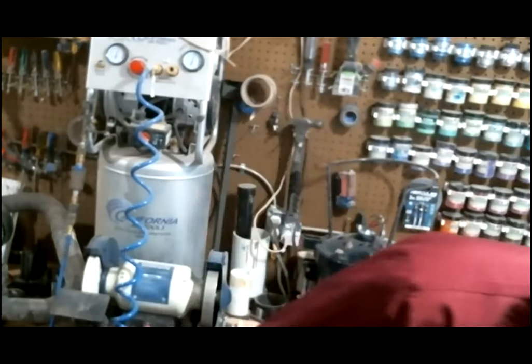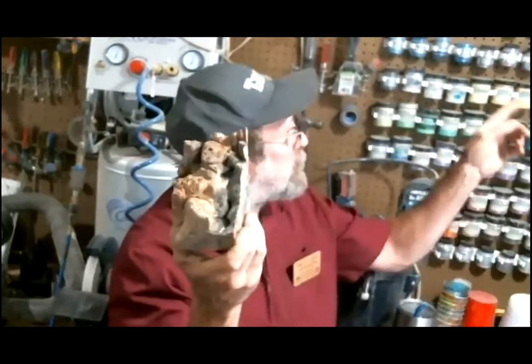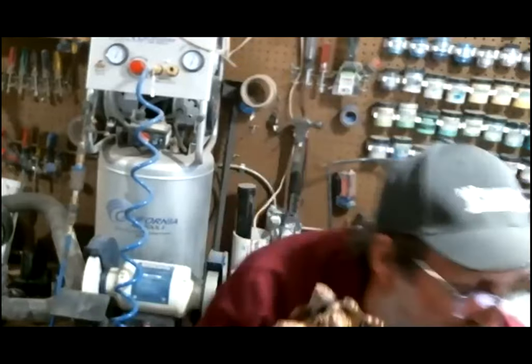So I let these all sit here for months, literally drying. And then when I know that they're down to that EMC content, 16%, 17% for me, then I can cut them into smaller pieces that would fit into my mold. For example, this piece would go into one of these blanks.